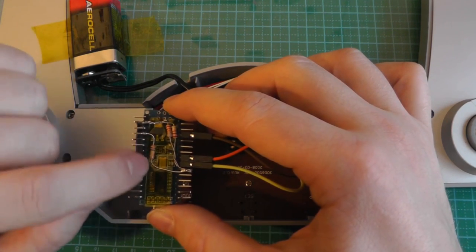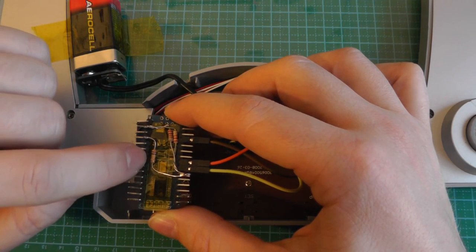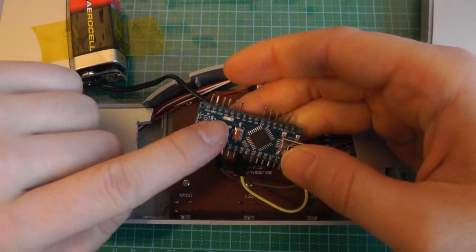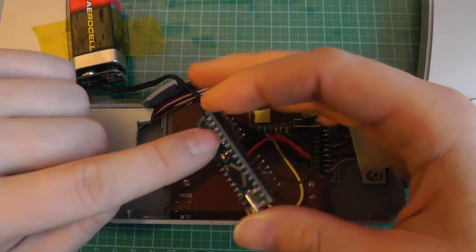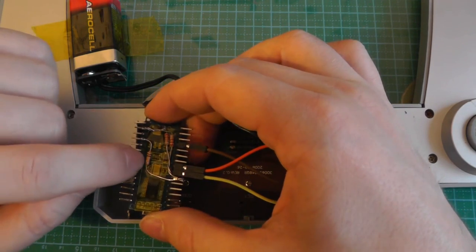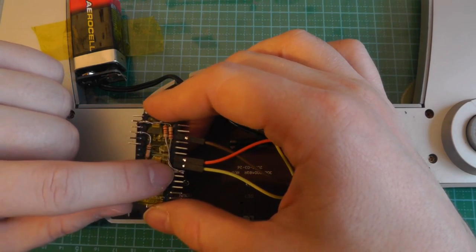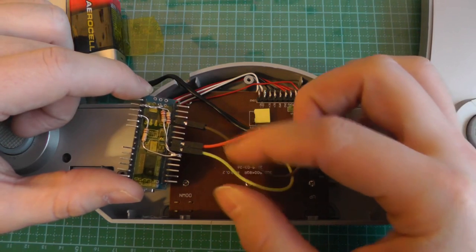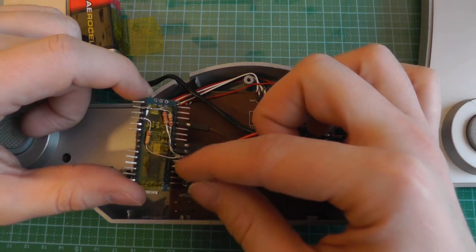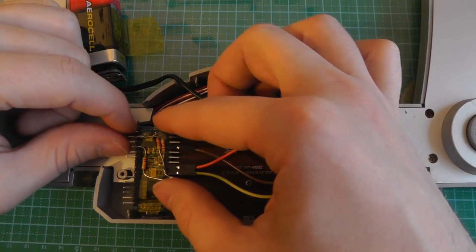This is also why you see the three resistors here. This is just a voltage divider. Here we have ground and plus 5 volts. I simply divide it by 10 using these resistors, and here we have a 0.5 volt signal. So whenever the pin, which is at 1 volt, crosses the 0.5 volt threshold, we have a 1, and else we have a 0. And this is how I can measure the signal and then trigger on whatever is on it.